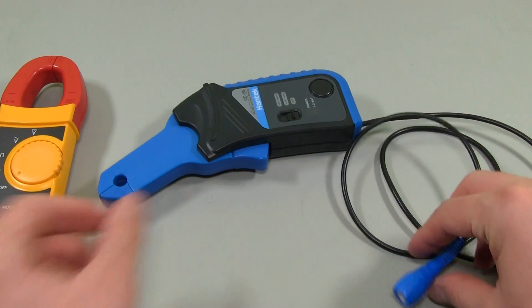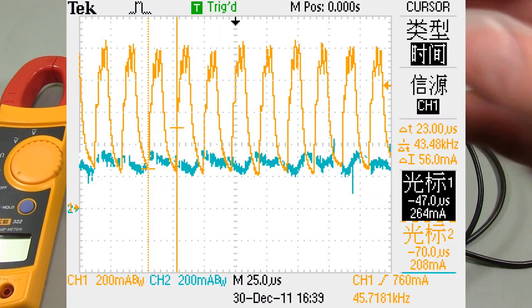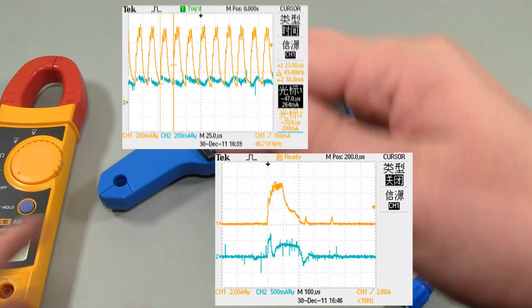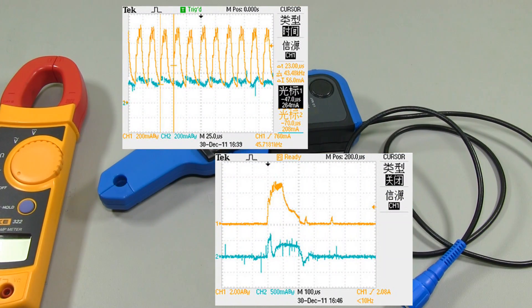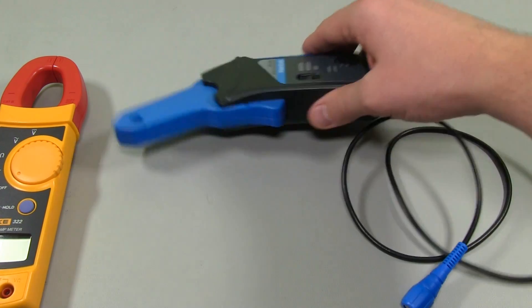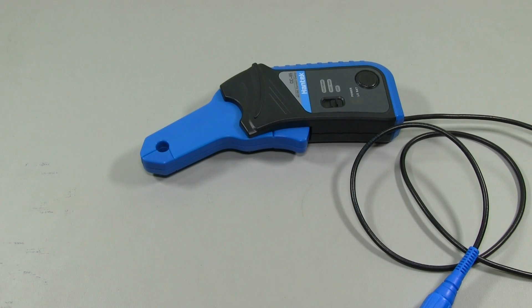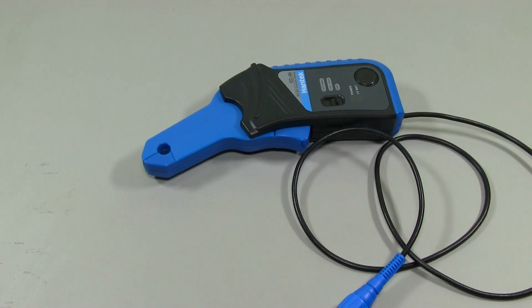It's very useful and handy for looking at loads on circuits. But the benefit of having a clamp like this one with a BNC connector is you plug it into your oscilloscope and you can actually plot that on the oscilloscope screen, capture it, see all the little pulses of current and all that sort of stuff. You can trigger on it as you would with a normal voltage measurement. So this is sort of like the lab version of that - not for site use. Let's tear it down now.